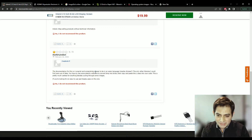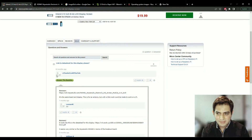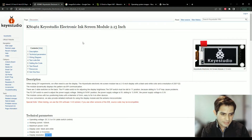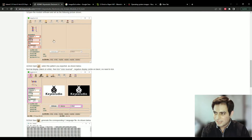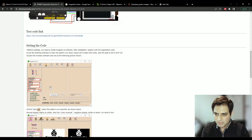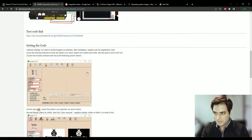What he's likely referring to is the technical information posted in the Q&A, which links to what appears to be the manufacturer's page. The only real differences are the color of the display and the connector color — the PCB color. If you scroll down, he's probably talking about the 'Image to LCD' software — the screenshots are in Chinese but when you download it, it will be in English. To convert your own images to BMP you can even use Microsoft Paint, but Image to LCD is the easiest way, and I'll show how to use it in a later video.